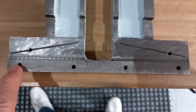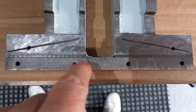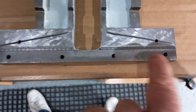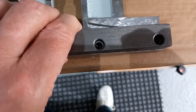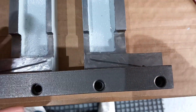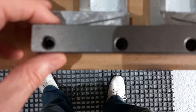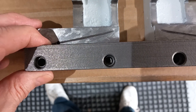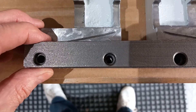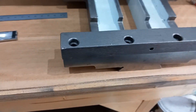They're not in line at all — there's a millimetre difference between the holes: 6.9, 5.9, 6.4, and 7.2. They've been drilled by hand, and when you look at how this lines up, well it just doesn't. This hole is nowhere near where it should be, which is why it was so difficult to get out — for that hole to line up it would need to be repositioned significantly.